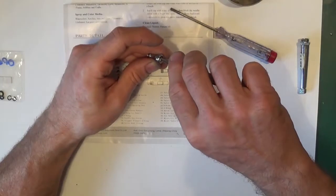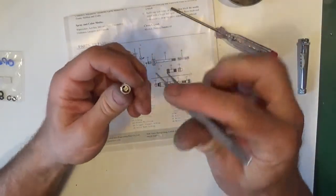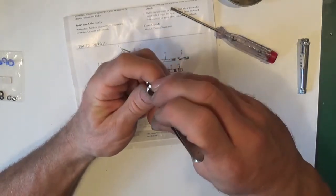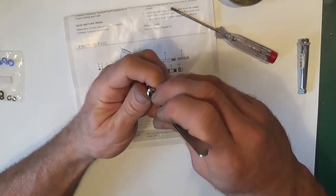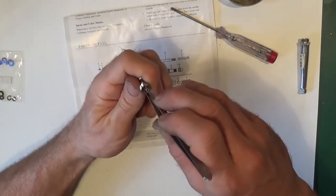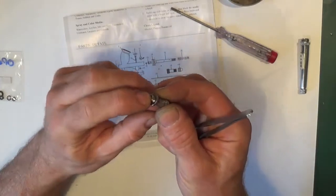I know it's going to happen. So there's nothing wrong with this airbrush. I'm going to lose a part. Demoing it. That's it. We've got it. And all you do is screw that back in. Make sure it goes in all the way. If it doesn't go in all the way, you won't get the full pressure. That's it. And then just make sure it's nice and free and it plunges. Yep, that's fine.